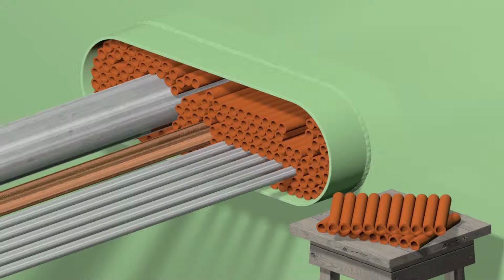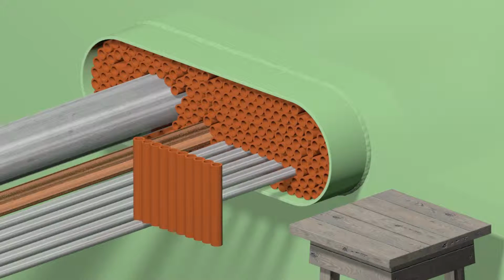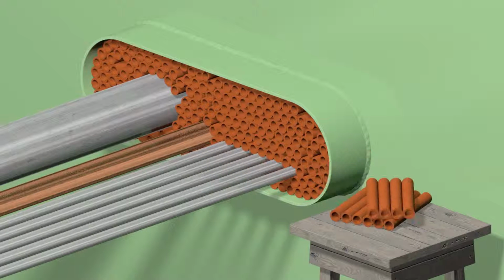The smaller openings are now filled with single sleeves or parts of the sets of multi-filler sleeves. To tear off sleeves of the set of multi-filler sleeves, the procedure is to do this backwards, forwards, and not sideways. This is due to the strength of the intermediate rubber parts.